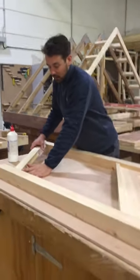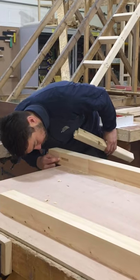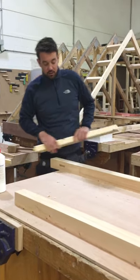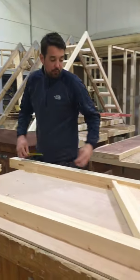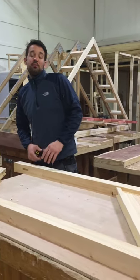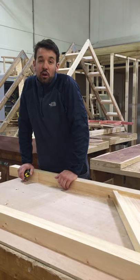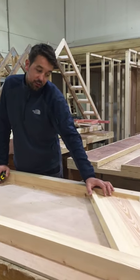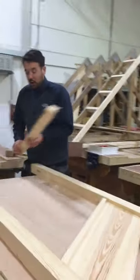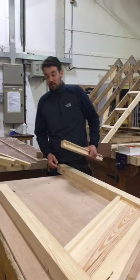On here, what I've done is I've done a tiny little mortise in there which this tenon's going to sit into. Now I've come up off of the base rail 900, because the minimum height of a hand rail in a domestic dwelling is 900 off the pitch line. I'm a couple of inches above where the pitch line would be, so I'm erring on the side of caution. My hand rail is finishing central to this newel here, so work that out.